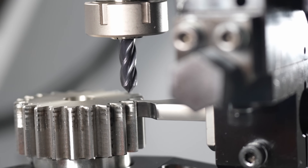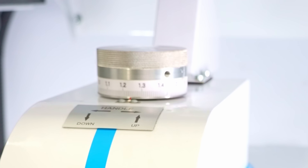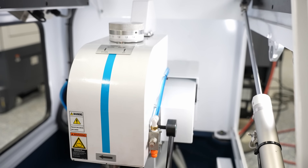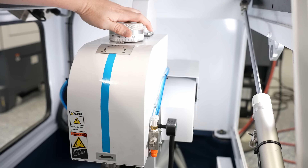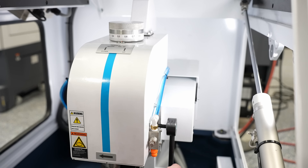The current setup is not going to work because my chamfer mill is way too high, so I need to bring it down visually in order for it to deburr the part. You can bring the chamfer mill and the entire stylus down with the knob on top of the milling spindle head. If you pull this lever back, the entire milling spindle can now move up and down. Turn the dial to a point where you think it's going to chamfer metal, then relock the milling spindle. Once done, hit manual return and send the whole unit back.